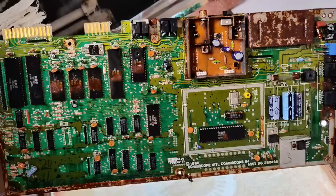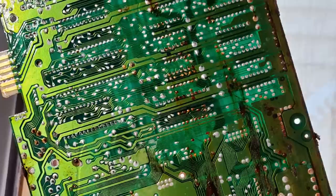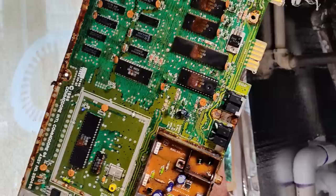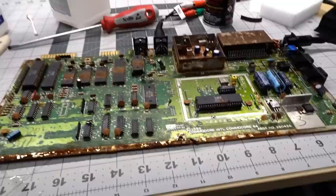I took the motherboard and used my garden hose to spray the PCB as clean as I could get it. I air-dried the board in my basement after washing it, then soaked it in 91% isopropyl alcohol to help displace the water. Looking at the board, I had a thought: could it be possible that this C64 still worked? Some people say these machines are very fragile and easily fail. But let's find out together if this computer that sat out in a field for who knows how many years could still possibly work.